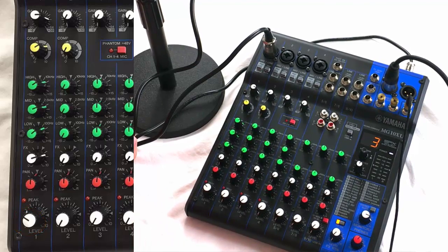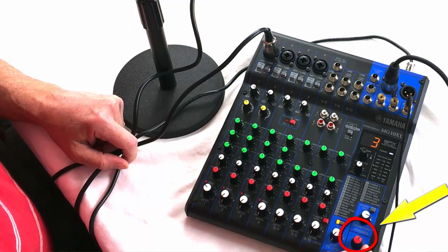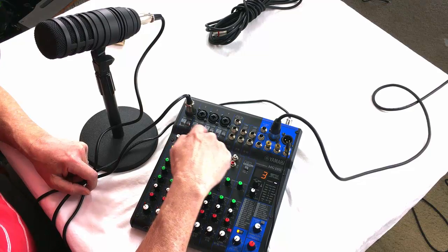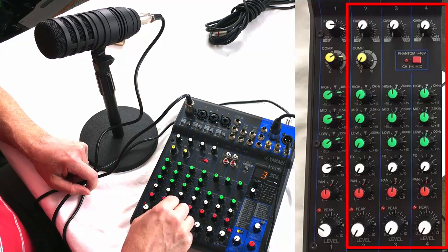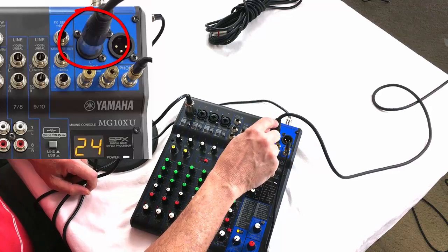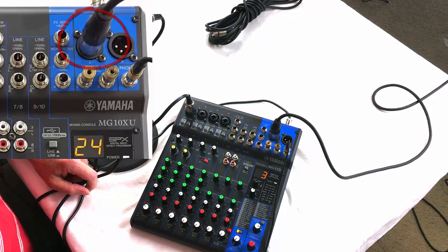The other main thing to know about is the stereo level. I had this cranked up to 3 o'clock and I was peaking the meters in the camera. Also, I learned that if you have any of these dials on channels 2, 3, or 4 cranked up at all even though you're not using them, you'll get a nice hiss — which you don't want. The main reason you want this console is to get a nice clean sound. And this is the output going to the digital SLR camera.